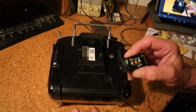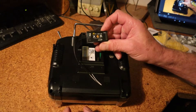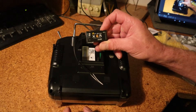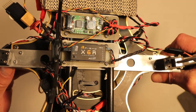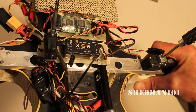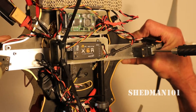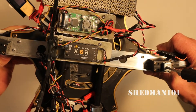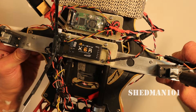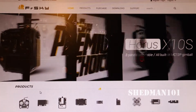For this stage of the upgrade and receiver change, we need to download the firmware for the receiver we're changing to. The receiver is an FrSky X6R - they come without any programming in them, so you have to download the firmware and program it into them. This is done by downloading it from the FrSky site and unzipping it onto your SD card or your Taranis transmitter. First thing we need to do is go onto the FrSky site.